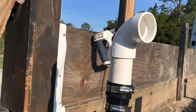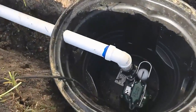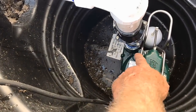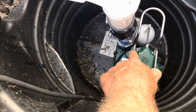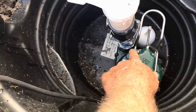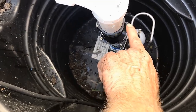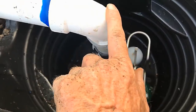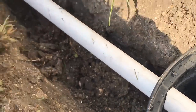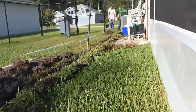We're going to put our no-hub coupling on, then a small riser. From that riser we add a 90-degree elbow so the line can come out underground — you won't see anything except the lid. To review: we've got the inch-and-a-half male threaded no-hub adapter, a small riser with a pressure relief, the check valve with arrows pointing upward, another small riser, and a 90 because we're underground — it turns and goes all the way out front.